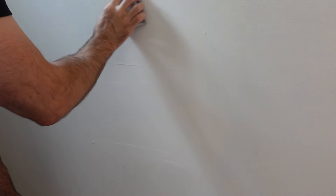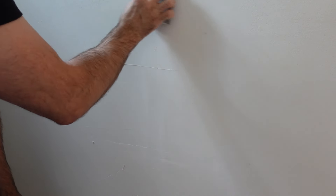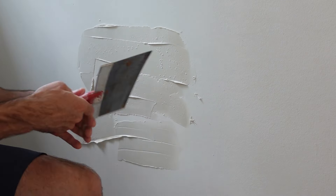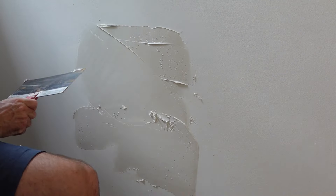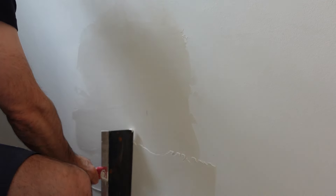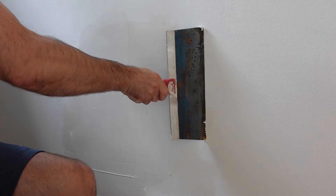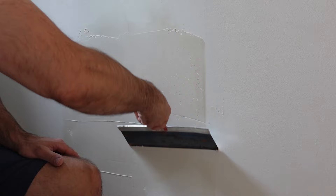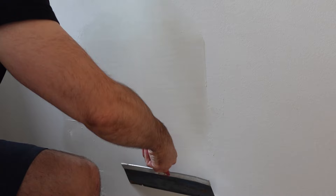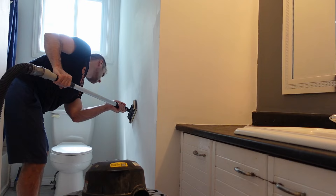The next morning I come back — there are still some ridges and peaks and valleys, but I have one more coat of drywall compound to go. I take my small 120-grit sanding sponge and knock down all the high points. Then I take the largest drywall taping knife I've got — I think it's 12 inches — and spread the drywall compound very wide on the wall so it blends in and you don't see any high spots or low spots, just a nice smooth taper all the way across. I still use the six-inch knife to apply the compound since the bucket is too small to get a 12-inch knife in.